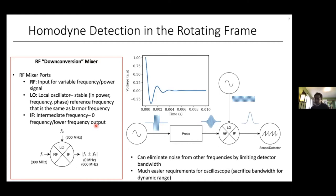The simplest way to use these mixers is in a homodyne detection scheme — 'homo' meaning same, so we're mixing two frequencies that are the same. We take the FID and mix it with a signal at roughly the Larmor frequency. At the output, we get an FID modulated at zero hertz — no longer oscillating at the nuclear or electron Larmor frequency. It basically only contains information about the offset in PPM and the T2 relaxation.